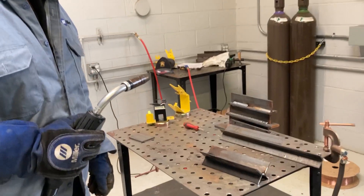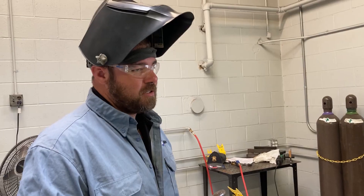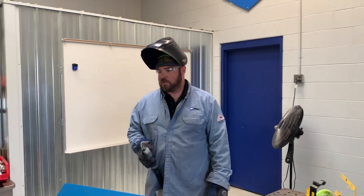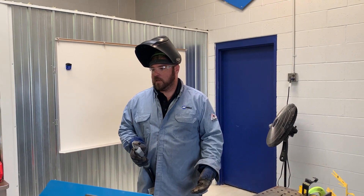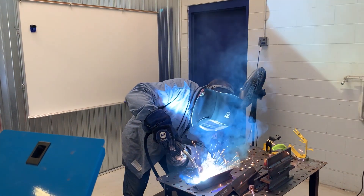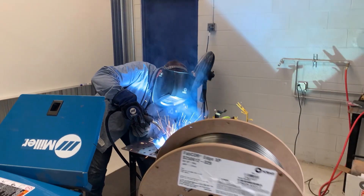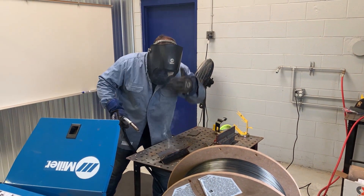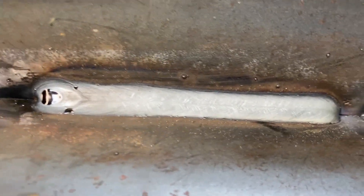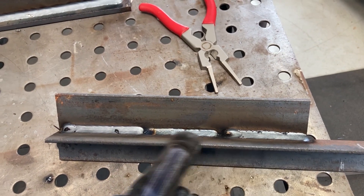This is Edge XP. This product is designed for welding on clean material — like shot-blasted, peened, sand-blasted material. It's not necessarily intended for welding on mill-scale, but the new XP will tolerate some. It is a metal core wire. It's going to offer faster travel speeds, and the XP is specifically designed to eliminate post-weld clean-up. As you can see, there's no silicon islands — it's ready for paint. Beautiful. Good job. 86, 56, Edge.